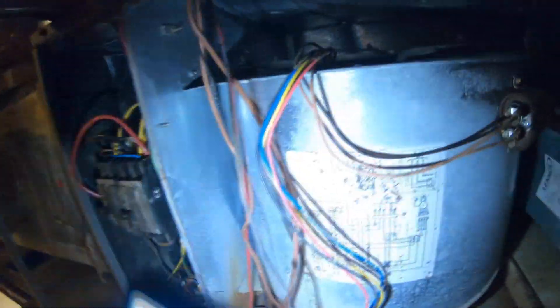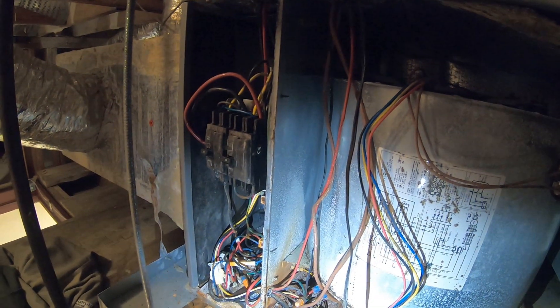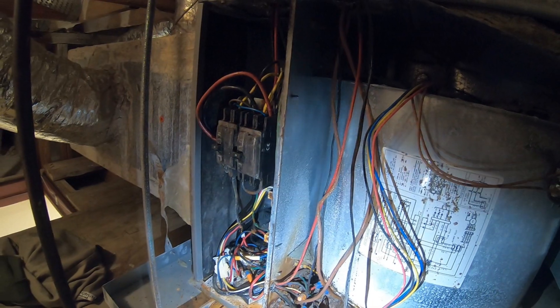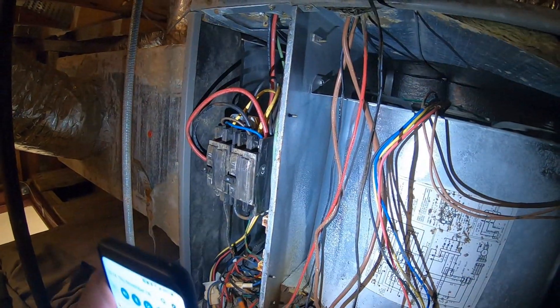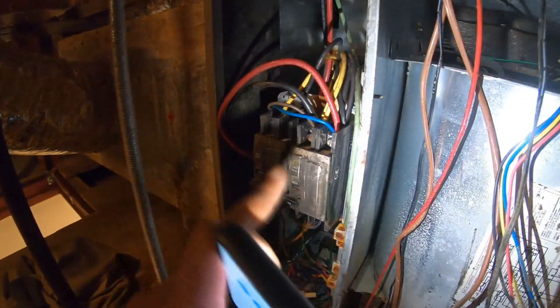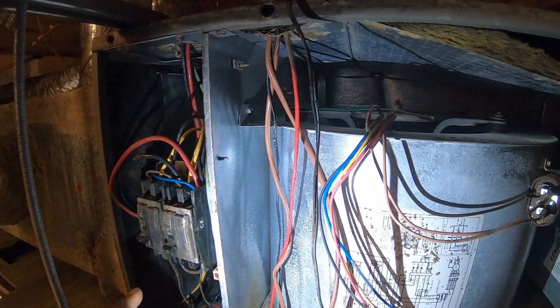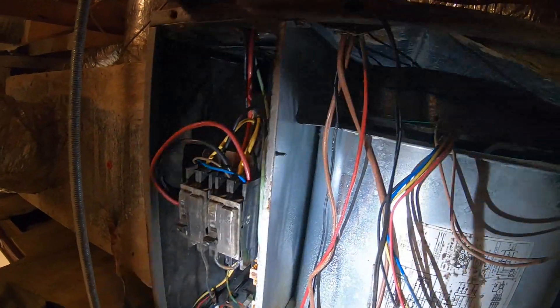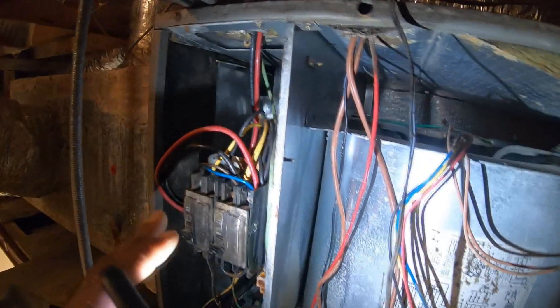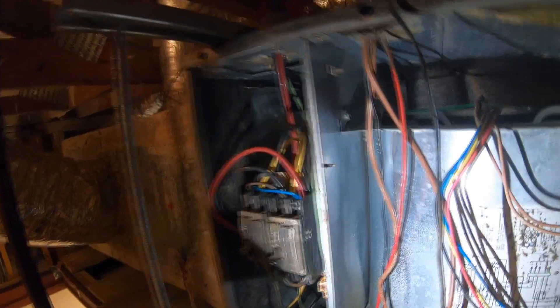Real quick on a safety note — you got to be very careful with your power. I know I don't speak a lot about safety on a lot of my videos but I am very cautious and use safe practices. You do want to verify voltage — disconnect switch is off. Even if it's showing off, they got the wires bypassed on the bottom. This could have been dangerous if the unit wasn't calling for heat or cool and was off when I got up here — if I hit that breaker and thought the unit was off and touched one of those lines I would have got shocked. I had to go to the disconnect box up there to give power to this unit. We got to be very careful and verify voltage.